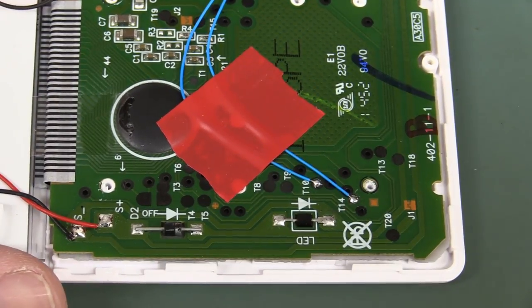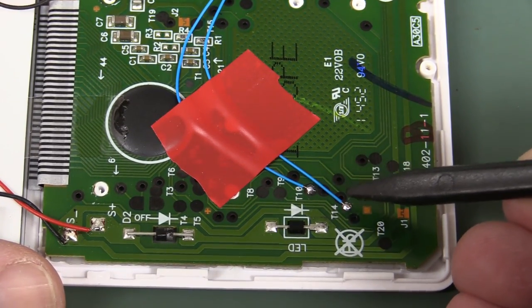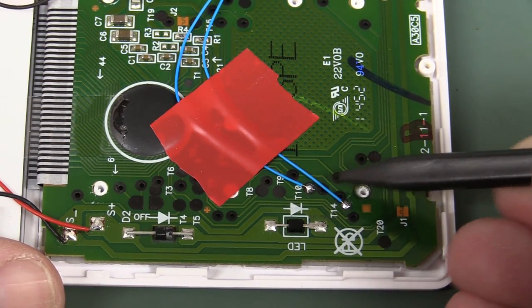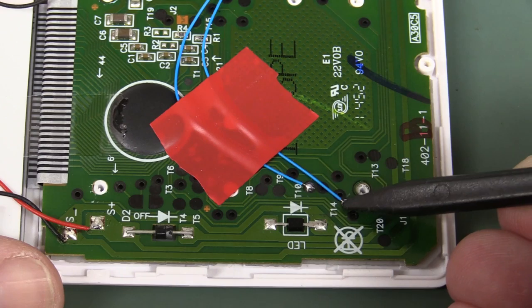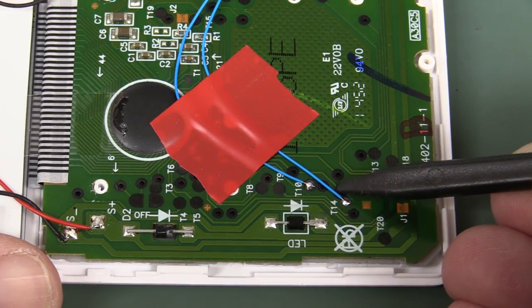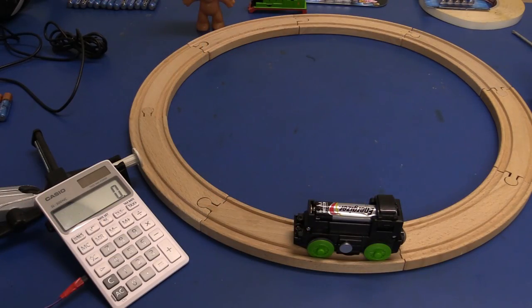Beauty. And by the way, in this case with the carbon covering the vias, that's going to be down the via holes as well. So I wouldn't go sticking your wires down there and soldering them into the vias. If we didn't have those pads there, I would have gently scraped off the top of the vias, being careful not to nick the wire in there, and just laid the wire flat on top. All right, let's give this a go.